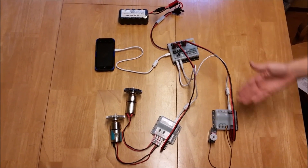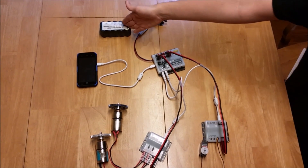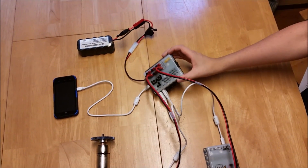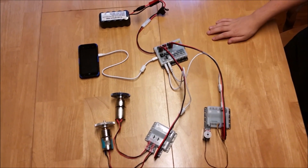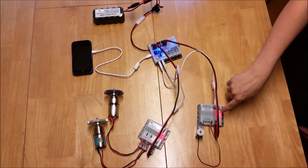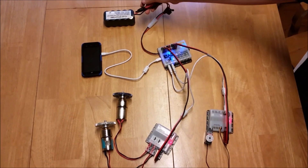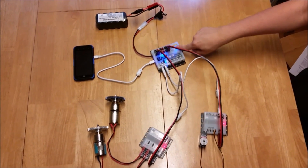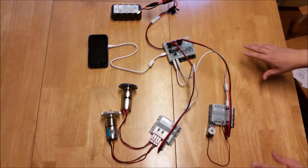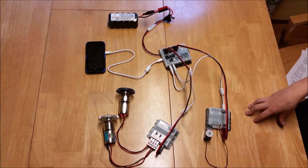At this point, your wiring should look something like this, where you have servo and motor controllers all plugged into your power distribution module, and you have your Android and your battery connected. Now we can turn on the main power switch, which is on the side of the power distribution module, and check to make sure that the power runs through everything. If you see any sparks, turn off your power. You should see LEDs on all of your electronics. If you don't see any, check your wiring and check your fuses — note that there are fuses on the battery and also one on the power distribution module. Once you've done that, turn off the power and make your wiring look nice. Make sure that your wires aren't spanning any open gaps and are nicely organized, as that can help with damage prevention and maintenance.